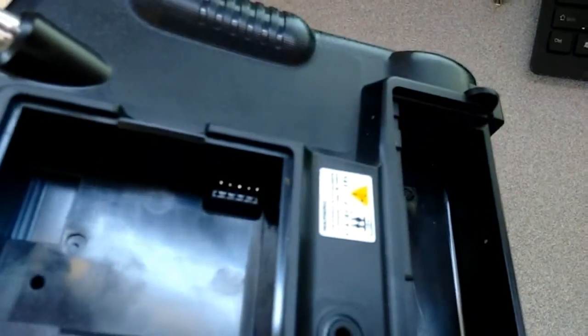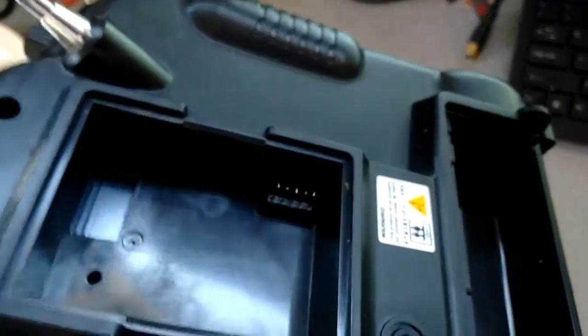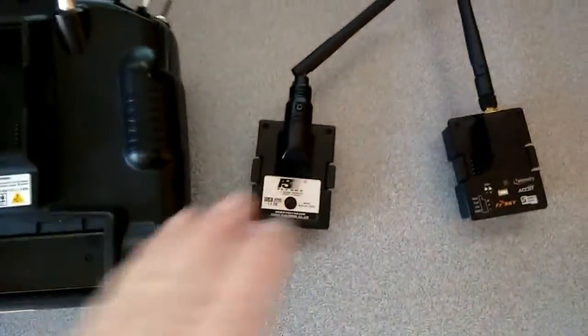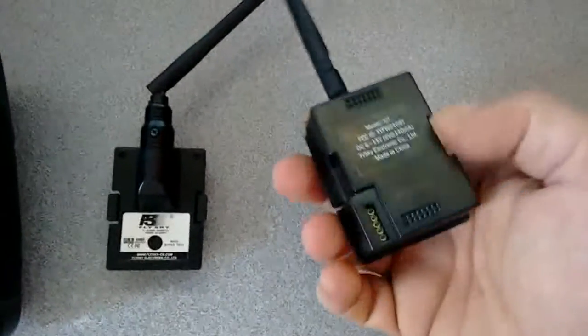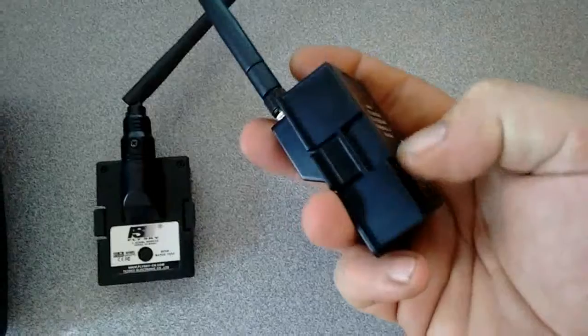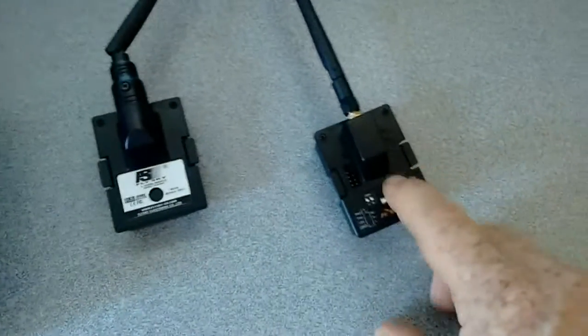So we're going to remove this little bit of plastic post that you can see just inside there that supports those pins. Those pins will have to go unsupported. Just be careful as you snap your modules in and out so you don't bend them, because you won't have that protection there anymore. But I have to remove it to get this in — the reason being this is not recessed anywhere near as deep as this one. And it goes damn close to fitting in anyway.